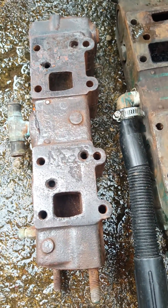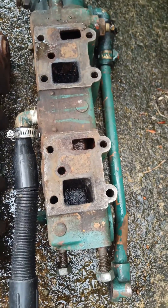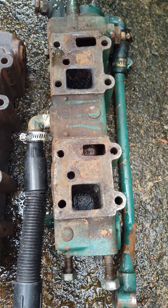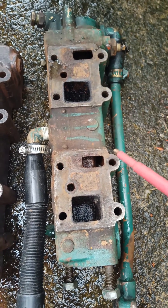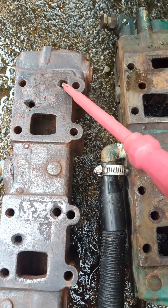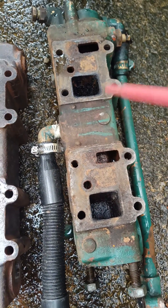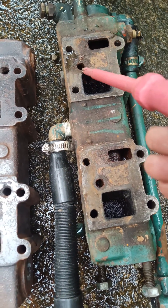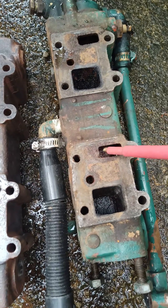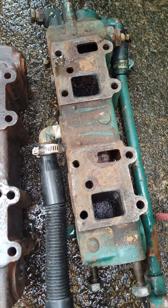So there's the old one with the cracks and the corroded ports, and here is one from MD2B, same as my engine. But what I've noticed is Volvo made a design change — they went from the small cooling ports to the slots. That is why I'm coming out the top of each cylinder, so in through that hole, around the cylinder, and then back out through that hole and through the thermostat and up this pipe over the exhaust.